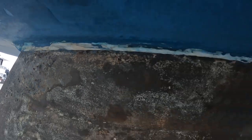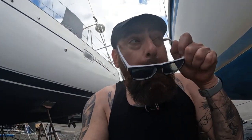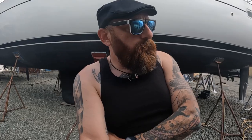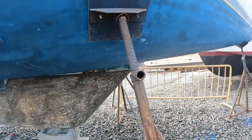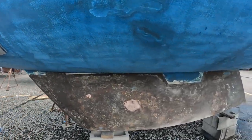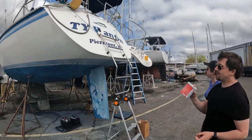Today he's doing a bit more grinding and then going to apply some rust lock on here. The plan is sometime this week we'll get down here and fair it out, and then he can go ahead and do the rest of the paint. He's using Rust-Oleum, which is smart. A little 5200 on the other side — we're going to do a little picking and a bit more 5200. Keel joint filled and she's ready for the water in about a week. It's coming along — she'll be in the water soon.